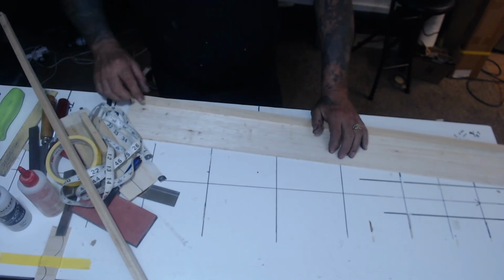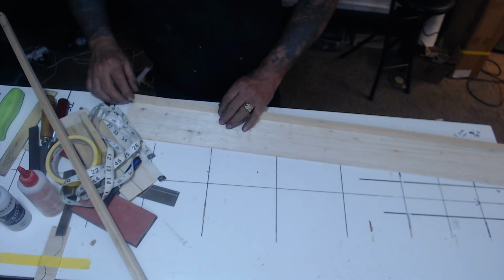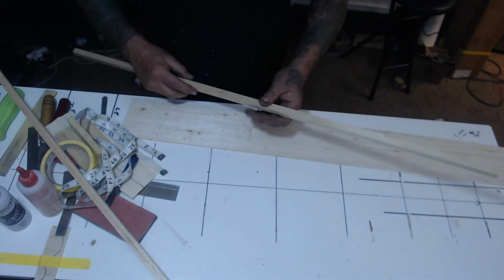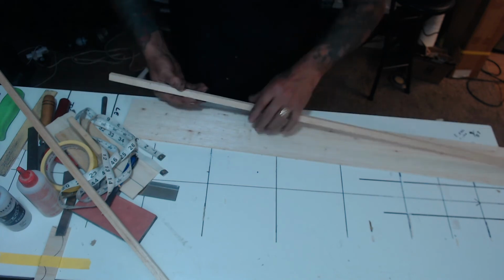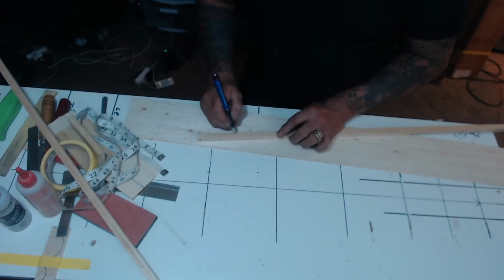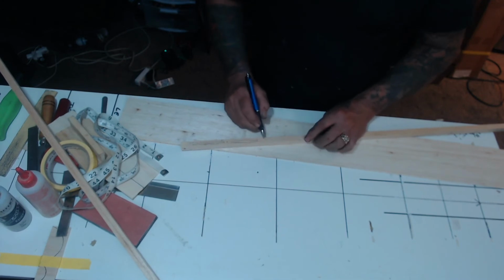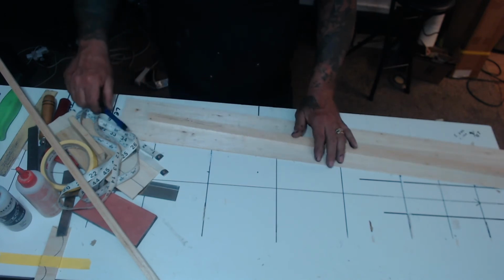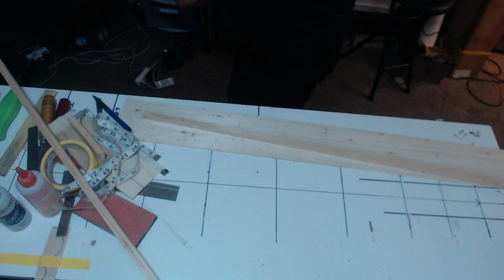So what I might do is take my gouge and route it out inside. Matter of fact, I know that's what I'm going to do. I got a Dremel router table. I'll set the plunge router and route a 1/4 inch groove in this and lighten it up by 1/2 and not lose any strength. I'm not going to do it tonight, but before I glue it on, I'll plunge route some slots in it and leave those right there for where the hinge pockets go, about every 2 inches. So we'll have to set some kind of jig up to do that. I don't want to do that tonight, but I'll take half the weight off of that. Let's see what that is.